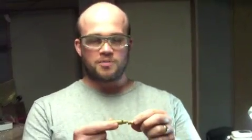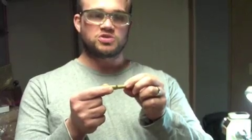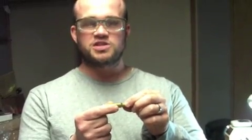So what I'm going to do is I've got my mandrel already in here. It's just a standard wood turning pen maker's mandrel. And I'm going to go ahead and put the shell casings on that mandrel with a couple of spacers in between, just regular slimline spacers. I usually put them on the machine going nose to nose like this. It just makes things a little bit easier when I sand it.